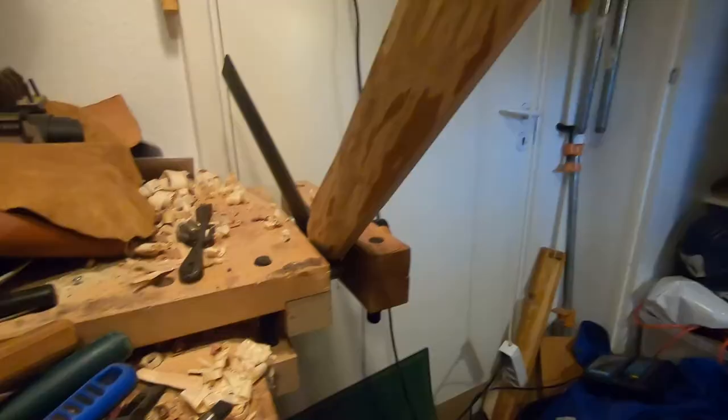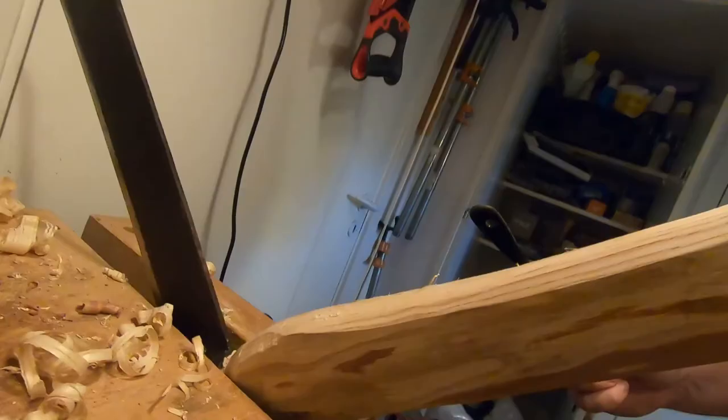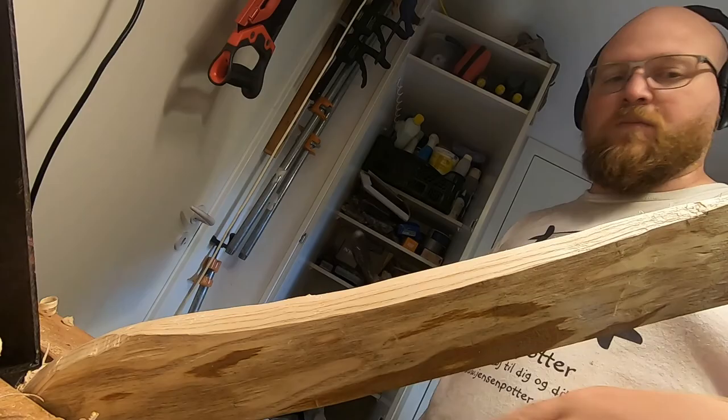It's easier when you have one point that's the thickness that you roughly want than to work towards it. Also, it's a good idea to taper the top of the handle, so if the head works itself down, it's not really a problem. It'll just fit even tighter.